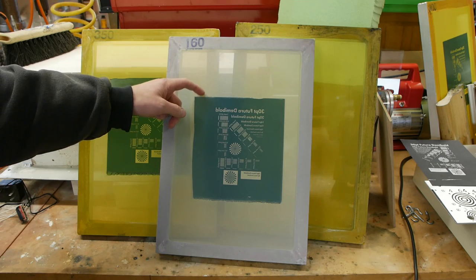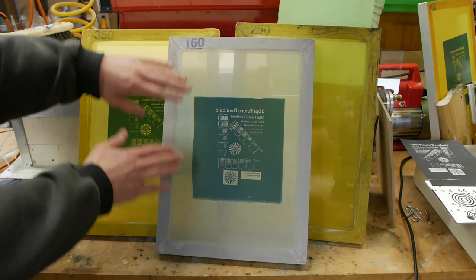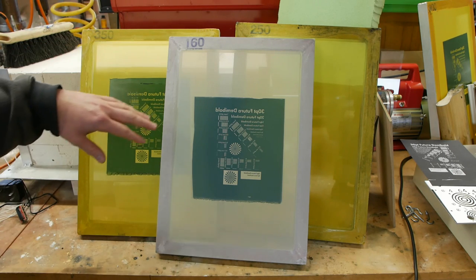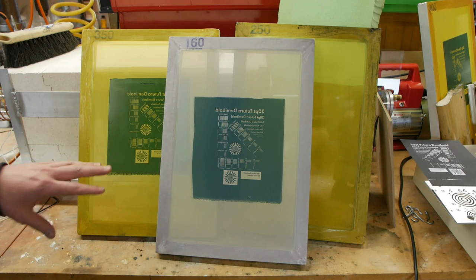The photosensitive layer actually has some thickness to it — I can catch my finger on the edge of this photosensitive material that we coated onto the screen. The thing that actually determines the shape you're going to print is in fact this layer, which can partially occlude one of the openings in the screen. So screen resolution is not really like a pixel count. Don't think of it like digital imaging where more pixels means a less pixelated image — it really doesn't work that way. It's much more of an analog process, especially because it's really the photosensitive layer that determines your ultimate resolution. Generally you need a fine support structure because the strength of the photosensitive layer is not that high, so if you have really fine details you need a fine screen, but don't think of it as a one-to-one pixel relationship.